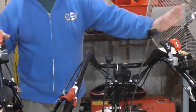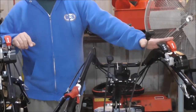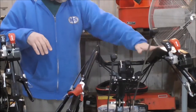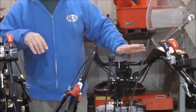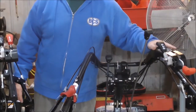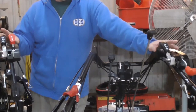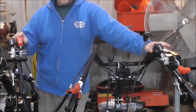On the 853, over here on the 852 with the controls looking identical — if I start this machine up and put it in gear and let my clutch out, it will go in reverse, where this one will be going forward. What that means is this is the reverse position on an 852 when you're in the rear mount or tilling position. So in order to go forward with an 852 for soil working, we would need to do this. Right now these machines would behave identically and you could run all the same exact stuff. The main difference is the orientation of these controls.